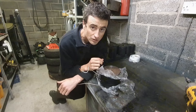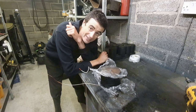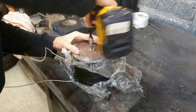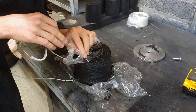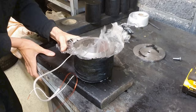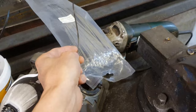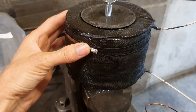It's been several days now with this paint hardening up - it's nice and dry to the touch and these parts feel quite firm. I'm going to remove the end caps because I need them to make the next coil, and let's hope the whole thing stays nice and rigid and doesn't fall apart. Luckily they all stayed in nice shape. Binding them tightly together with the addition of the paint and the fiberglass makes basically a GRP shell - excellent result. I also have stainless steel cable ties I'd like to put around the coil in maybe three locations, because they are subject to mechanical loading when the magnetic force pushes the coil as it's switched on and off.